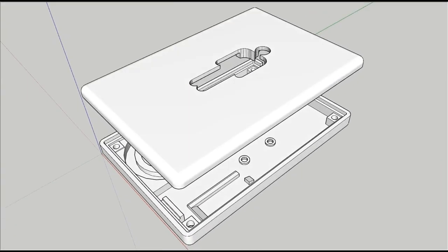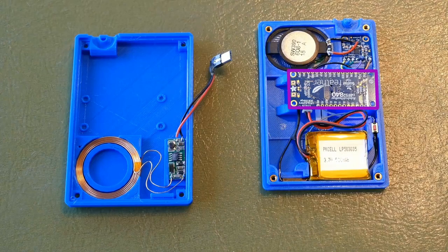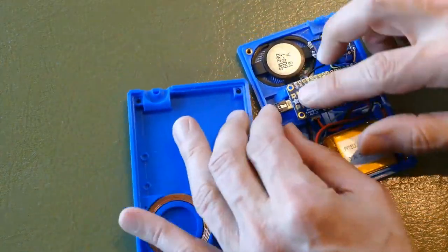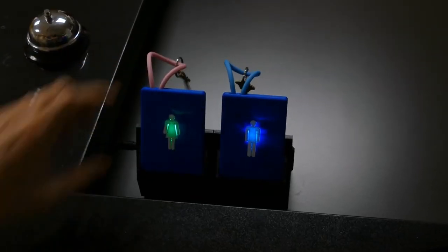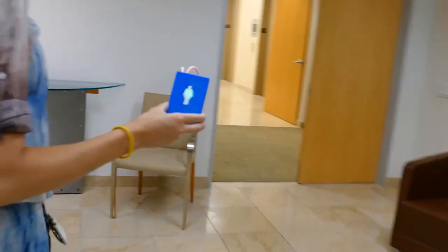The key fobs themselves are a pretty thorough lesson in compact design. Each one houses an nrf52840 express, a 3-watt audio amplifier breakout, a waterproof speaker, a 500 mAh battery, and an inductive charging coil. The key fob itself is a 3D printed case indicating which restroom the key unlocks, and the NeoPixel in the microcontroller shines through the case to indicate battery status as well as proximity to the beacons.